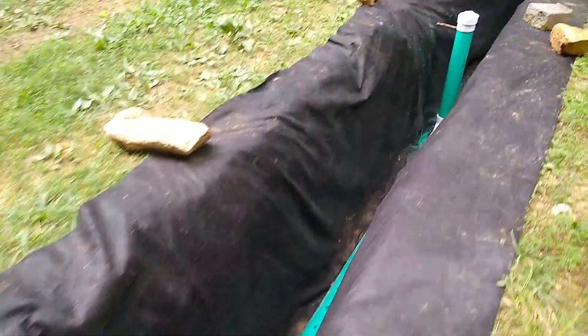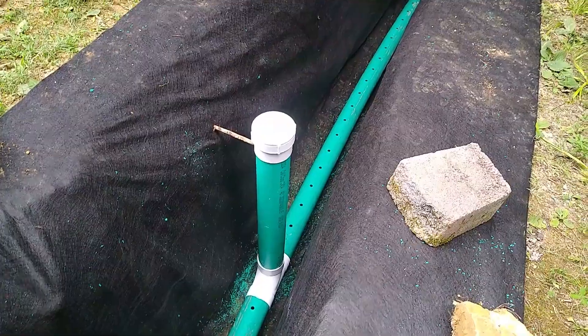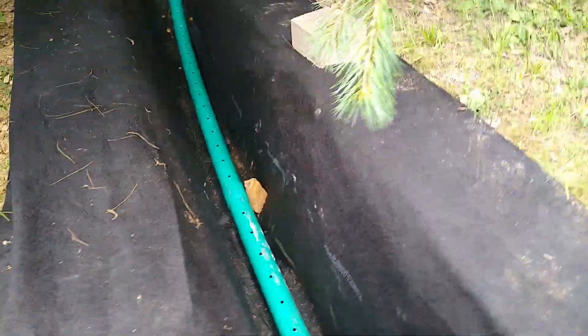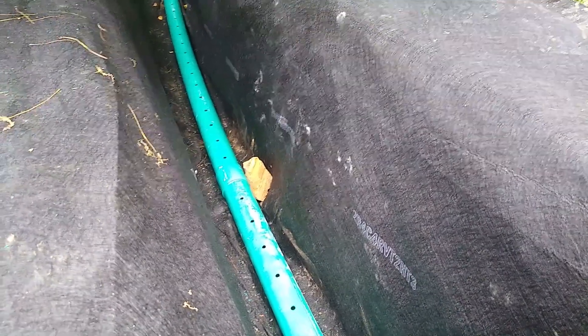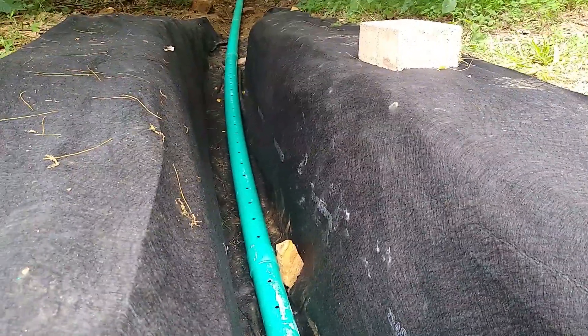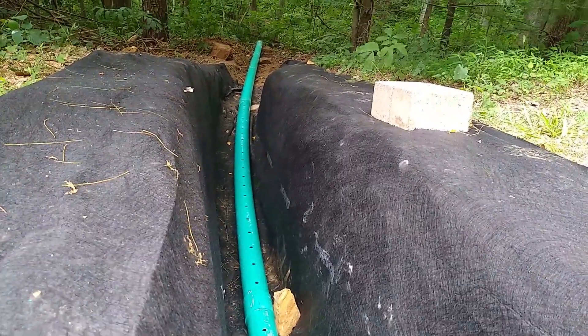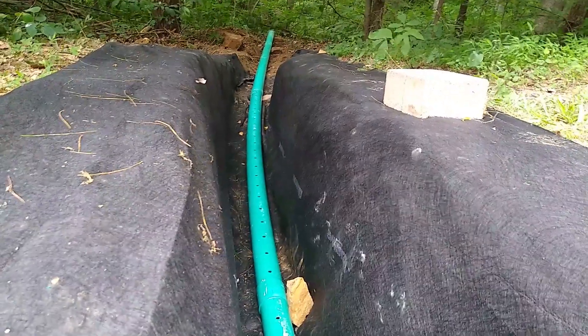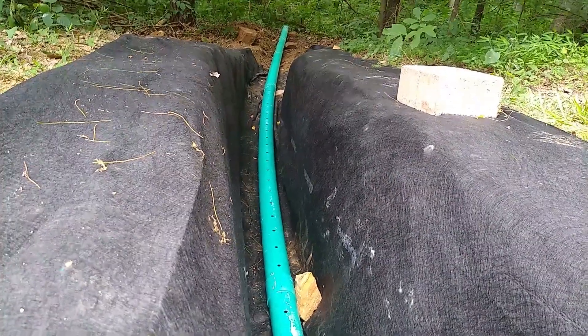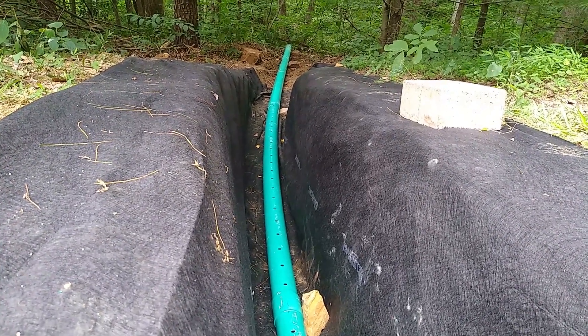This is another service clean out. When you do put these pipes together, make sure you use a lot of glue. I bought a quart of glue and I didn't even use it all. I didn't put enough on a couple of times and I couldn't get the pipe to go on all the way — you want it to go on all the way so there's no lip in there that causes it not to flow properly. Most of the water is going to be coming out through this gravel because I'm going to leave it open, and on the ends I'm going to terminate with some rocks and then I've got a regular pipe going to the end with a screen on it.